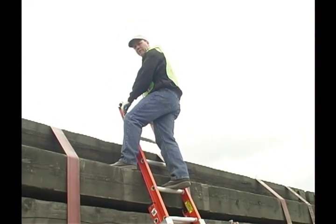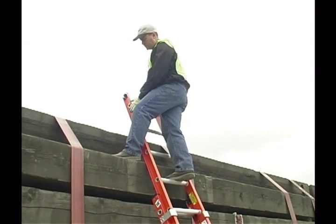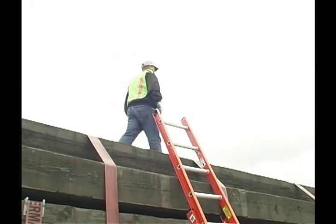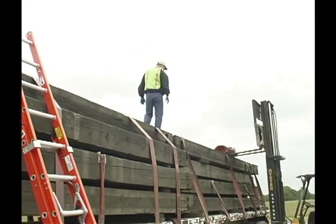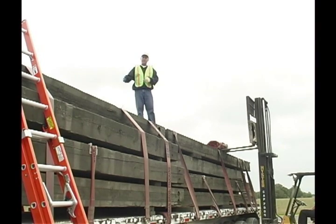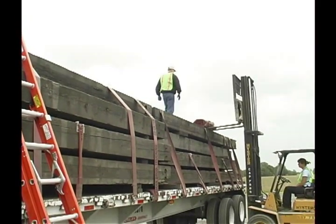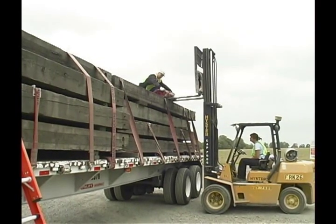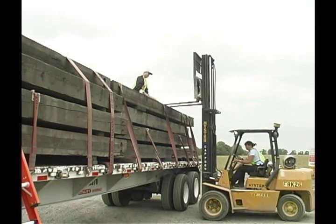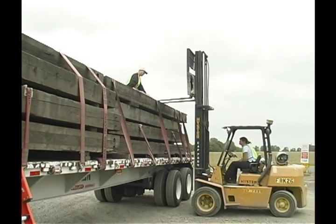Right here is the time to slow your mind down. Quit worrying about anything else — you're doing a high-risk operation: transitioning from ladder to load. Having that three feet of ladder extension gives you a balance point. Be aware of danger spots — there's a hole in the load, and when it's covered up with a tarp you can post-hole through it and break your leg. Get down low to lower your center of gravity, get the tarp off the forklift, and thank the forklift operator. When maneuvering tarps, let the load support the tarp as much as possible — swing it around and roll it.